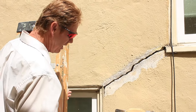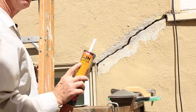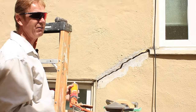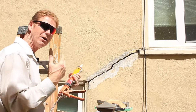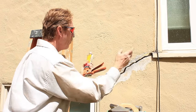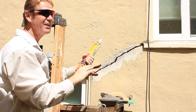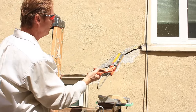I told him, I'm already here, I'll use this product here. This is a rain gutter sealant and it has adhesive, so we're going to pump this whole tube in here. A lot of these polyurethanes say they'll go up to three-eighths of an inch thick, so I'm going to fill this up with this whole tube of polyurethane. The reason I don't use stucco — which would take me just a swipe — and instead use this, is because once it's installed in here it'll flex. Caulking, even though this is strong stuff, it's not going to hold a 50-ton house together. But this is what I would do if it were my own house.